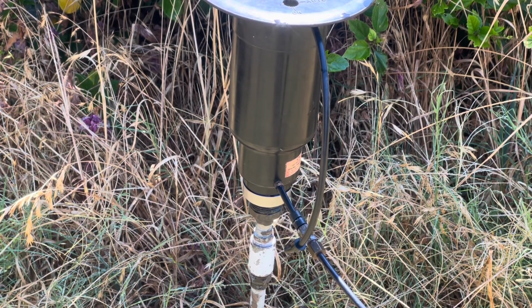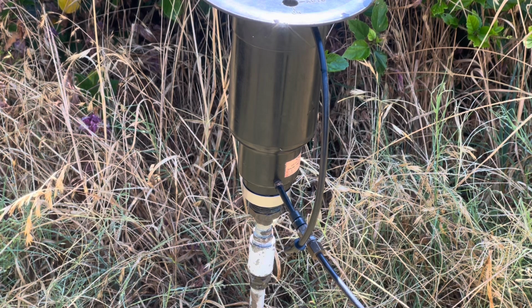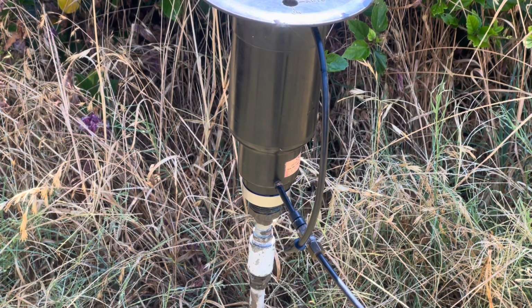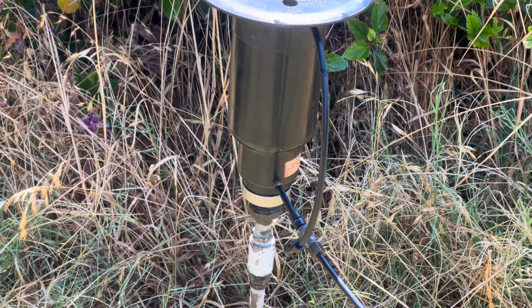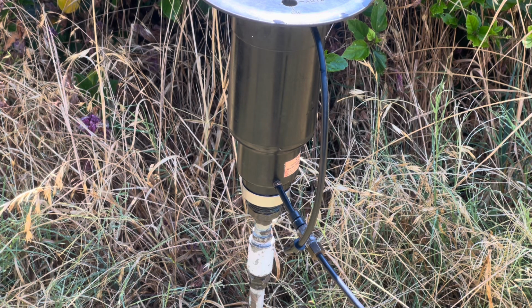One last final thought I forgot to mention in the video is what the control tubing pressure needs to be. In this case, it has to be equal to whatever the water main pressure is that's supplying the head or the remote valve. For example, let's say you've got 100 pounds pressure in a system that feeds all the sprinkler heads or remote valves. The control tubing has to be 100 pounds as well. If you have an offset in balance, the system is not going to work. The valves won't stay closed, or the valves will not open if it was a normally closed system. So that's pretty important, something to think about.